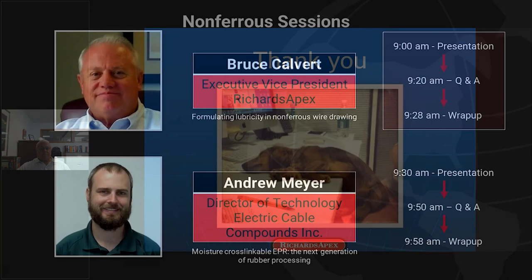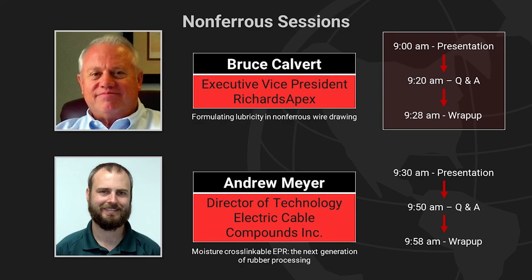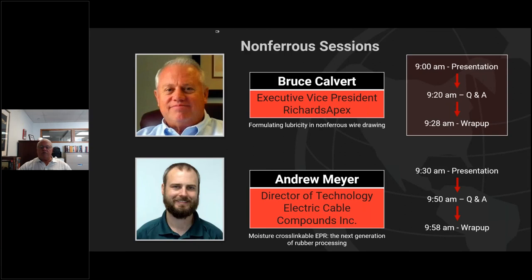Thank you, Bruce. We have a few questions that came in. How do water-based lubricants work compared to neat oils? Well, that's a very good question. There are a lot of theories about how these things concentrate. You have to concentrate, capture, and pressurize these lubricants. The first step is really to concentrate, and that's where the trick lies — you have to somehow coalesce those dispersed droplets and feed the contact the oil rather than the water. Water is a terrible lubricant because it has a very low pressure-viscosity coefficient.